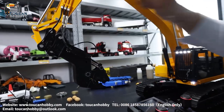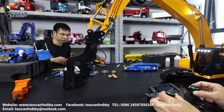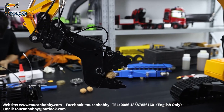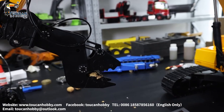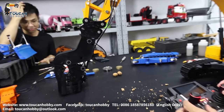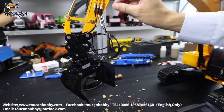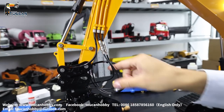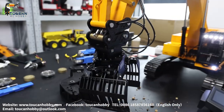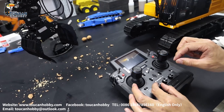For the hydraulic pliers, also connecting to this channel. Start the pump and open it. For the pliers, we use two channels for the spare oil — one channel for spinning, the other channel for opening the grab. Start the pump — only low load is enough. Don't start the pump at full load, not too much pressure — only a little.